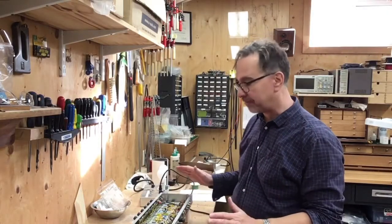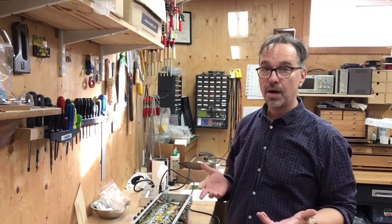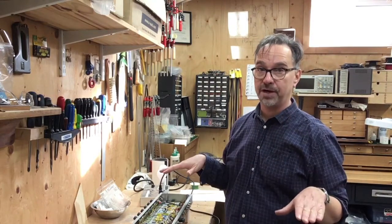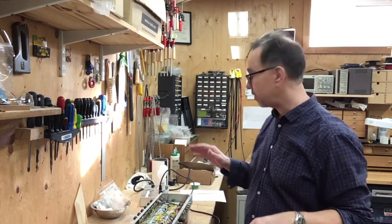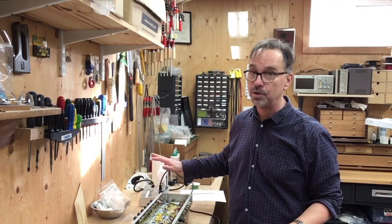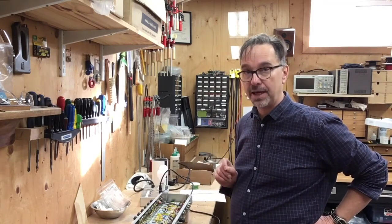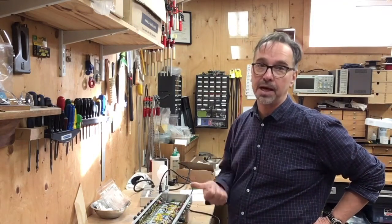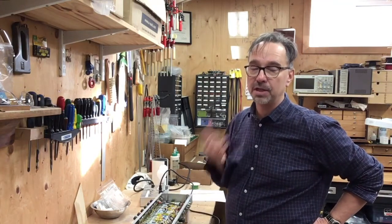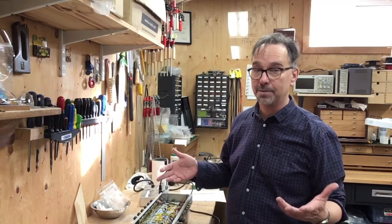The wiring is done and the amplifier is complete. Now we just have to bring it up. How I like to do this is to start with no tubes in the amplifier whatsoever, powered up using the dim bulb tester. Always have that in when you've got a new piece of equipment you're starting to bring up. Then I check all of the AC rails — the heater supply, the heater for the rectifier tube, and the B+ rails. Essentially we're just checking the power transformer.